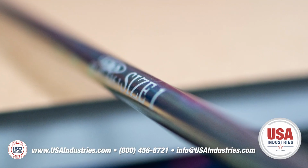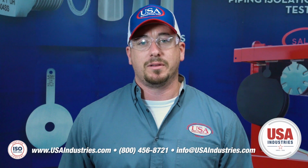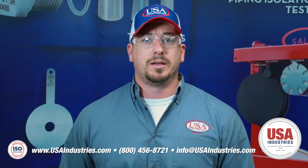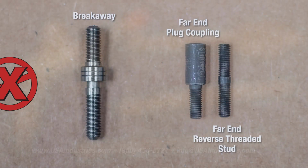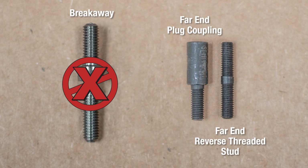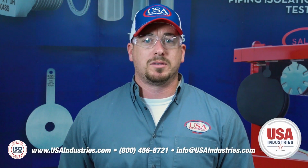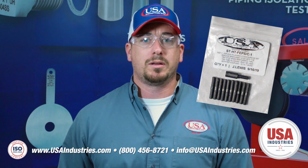Today we're going to be using a size 1 channel head pull rod assembly because we're going to be installing a size 555 Snap-it Junior plug. Just as we had mentioned before, the Snap-it plug is a 3-piece plug. It has a pin, a ring, and a breakaway. Today we're not going to be using the breakaway. We're actually going to be using our far-end plug coupling to go with the far-end plug reverse threaded stud. The coupling and stud can be purchased separately at USA Industries. When you do purchase them, it'll be 1 coupling for every 10 reverse threaded studs.